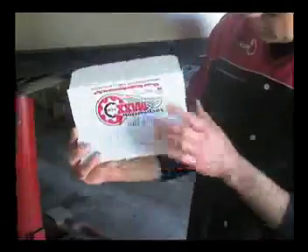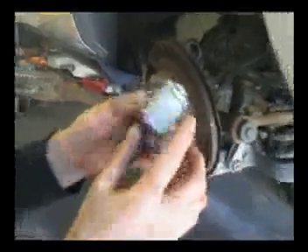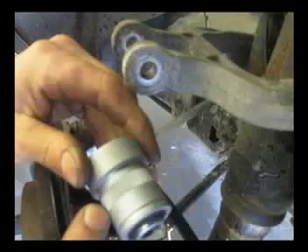We're going to repair this car with the Suspension Max kit. This kit includes two of the required knuckle bushings for the lower control arm — Suspension Max module bushings, ready to be installed. We're going to take off this snap ring, which is going to allow us to install it. The other patented item: we knurl the outside of the bushing so that it's guaranteed to fit every housing. Ready to install it.